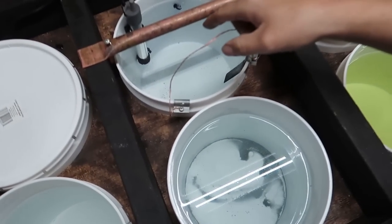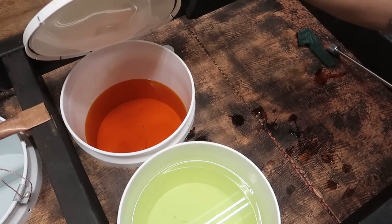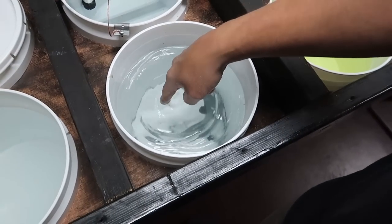That's my setup — that's my progress, my introductory into actually doing zinc coatings. I will most certainly keep you guys up to date. I'm going to order some brightener to put into our zinc bath, and I really think it's going to be important to get another one of those heaters so we can bring the temperature of the yellow chromate up to 90 degrees. It does tell you it needs to be at 90 degrees, and right now these buckets are really cold. We have some improvements to make and I'll keep you guys up to date. I hope you guys enjoyed this — I just wanted to show you the setup and bring you along with my progress. It can only get better. Anyhow, I'm gonna throw this video up and get back to work on that Blazer. Peace.